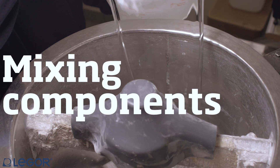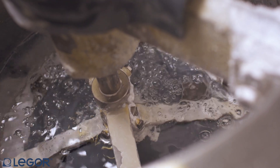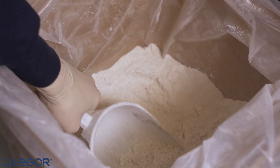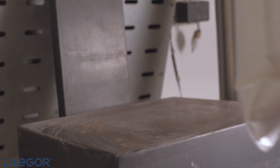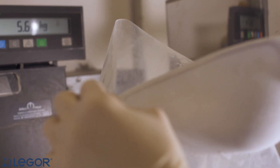The difference in water content allows correct timing for mixing, pouring, and standby before burnout when temperature changes. For best results, we suggest to keep investment powder and water in a controlled, cool temperature environment, between 20 and 25 Celsius degrees.